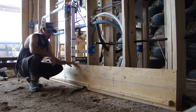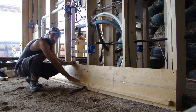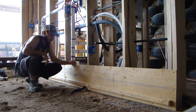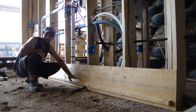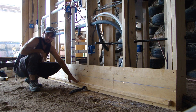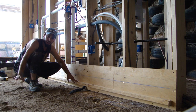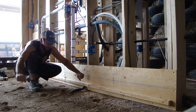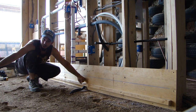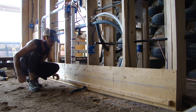We put a 12-inch piece of half-inch plywood on our wall here. This is to create formwork for the concrete pour — it's going to come right up to it. We also have a 2x2, and the top level of this 2x2 is at 4 inches, which is at finished floor level. This is to create a screeding ledger. When we're screeding our concrete and making it flat and level, we can take our screeder, rest it on this over to our other screeding ledger, and just screed our concrete to the right level.